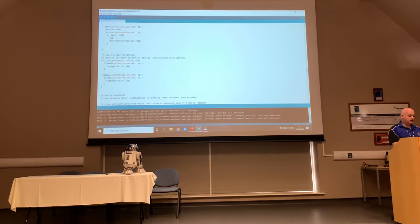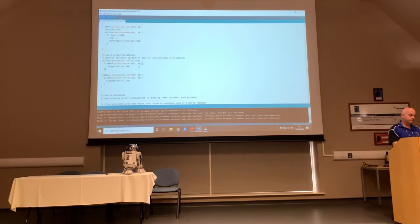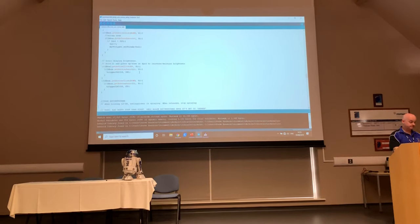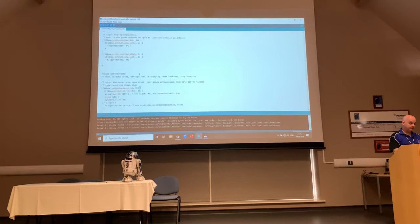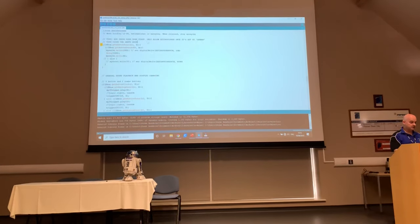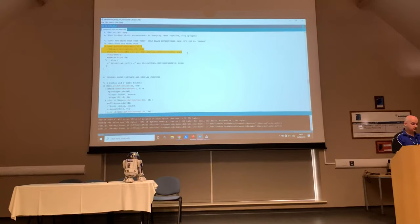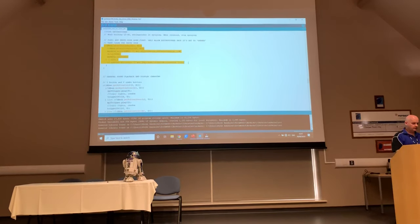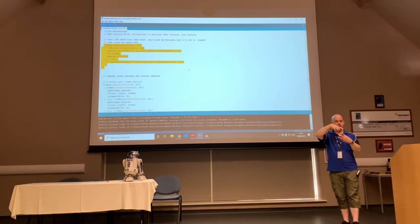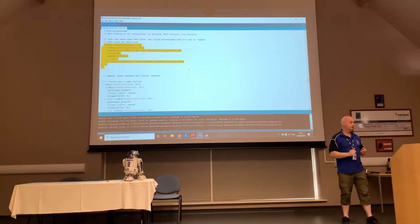The next part of the code is if you're using I2C, which we mentioned before, then you can actually change the brightness of your dome Arduino controls. I say I don't use that. There's a bit in there about using my fire extinguisher. So basically, if I do L1 and up, it's going to send a digital write to that servo. So on my gas canister, I've got a little 3D printed lever, which has got a servo attached to it. So it basically pulls it down and then lets it go back up.